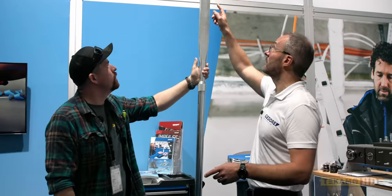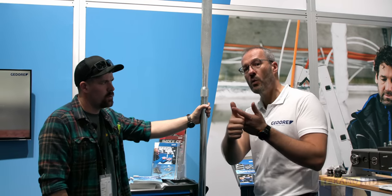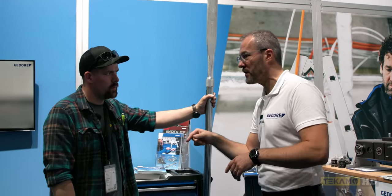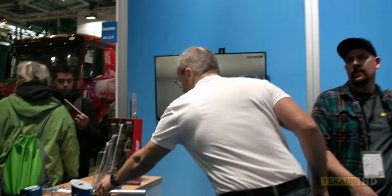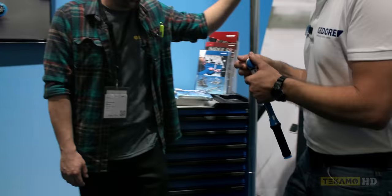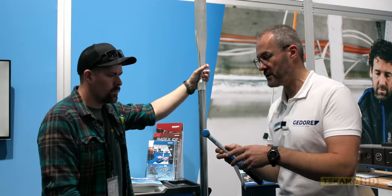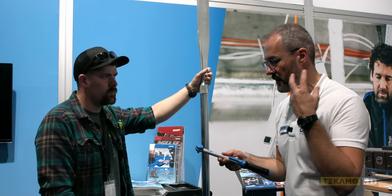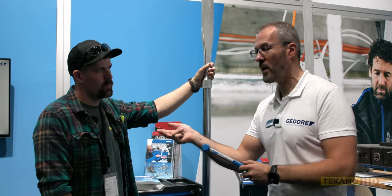So you can test it in the field — you guys sell that as well as a tool? Yes, up to 3,100 Newton meters. So they sell up to 3,000 Newton meter field testing units. That's something I'd be interested in — having something to check our own torque wrenches in-house instead of waiting for the Snap-on guy to show up once a week. On the square drive, we're talking about a two-side, one-side calibration. When we have a double square drive, we can change the direction, but only one calibration.